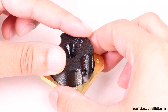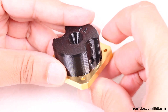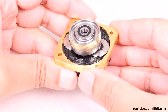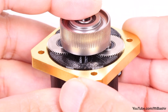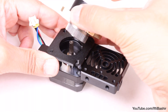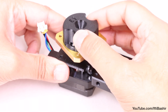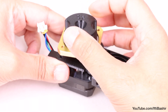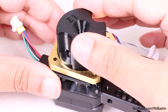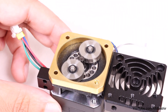Holding the entire assembly between forefinger and thumb, slide the ring down with a slight wobbling motion so that the teeth mesh with the gears until both are flush. Don't be concerned if the ring doesn't feel like it's turning smoothly just yet — it will once the plastic tool has been removed. Now, holding the entire structure in place, lower onto the motor shaft so that the shaft enters the hole in the central gear. Do not force it — let gravity do the work, slowly turning the assembly until it drops into place. The gear adapter can then be removed.